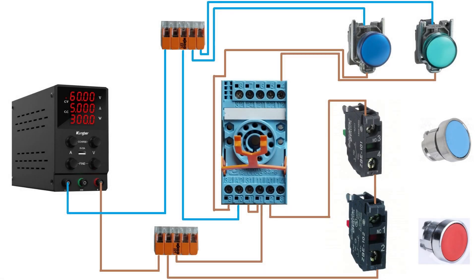Next I will have to add a new wire. It will be wired up from Terminal 6 on the relay socket to the same side of the normally open contact block that is connected to Terminal 2.